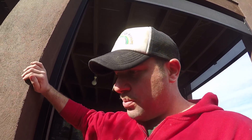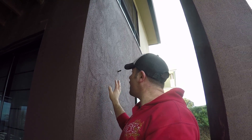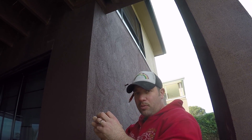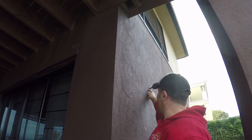You need to make sure you prep when you build in a place like this. If you're going to be doing rendering, try and get a galvanized metal edge first, and then plastic second — preferably not plastic if you can help it. You can see the salt sitting in here, eating into that external edge. And this here is a dynabolt. People put fixings like this into their walls near the sea all the time. What ends up happening is that will expand into the brickwork with the rust getting into the metal and it will pop all of the brickwork and the render all around it as well. You won't just have to fill that — you'll have to grind all of the mortar out around it and fix the whole area.